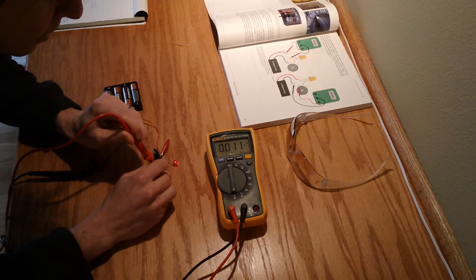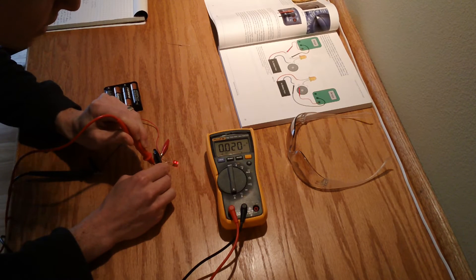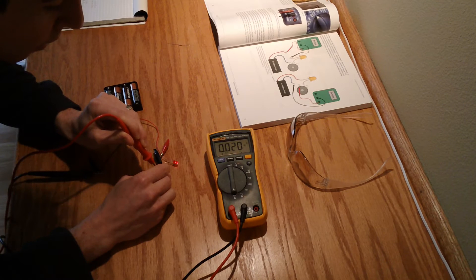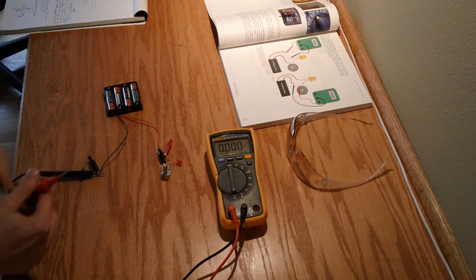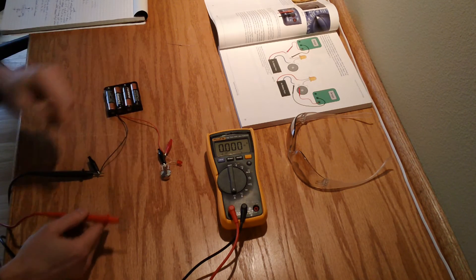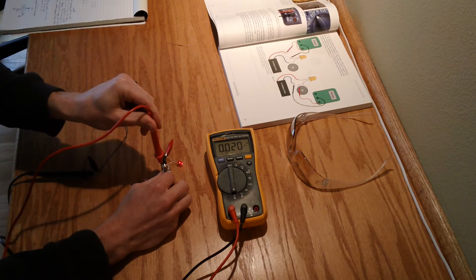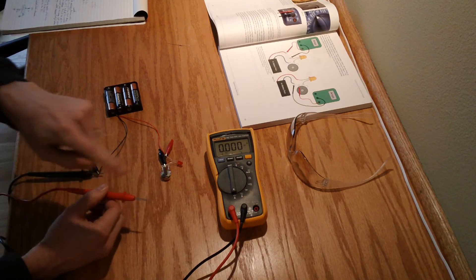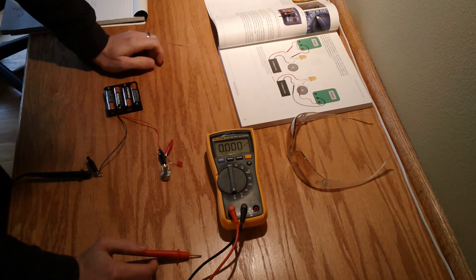Since this is an LED, we usually shoot for around 20 milliamps as the optimal current. Right about there, it's about as bright as this particular LED will go. We are measuring 20 milliamps because we are in series with this circuit. Using conventional flow, power goes through the multimeter and back out, continuing into the black lead. Of course, realistically, electron flow is going the opposite way, but we'll keep things in conventional for now. That pretty much wraps up the LED part of this.